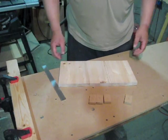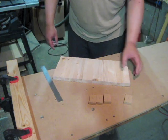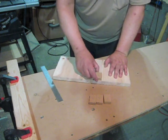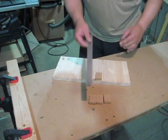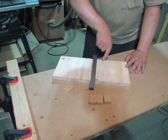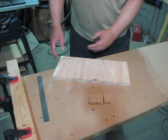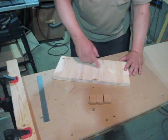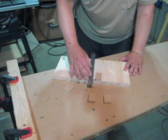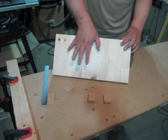So what's the point of these little blocks? Let's pretend this is my sheet of plywood and I've got a line marked — say two feet from the end, and that's the piece I need. I'll use the wide blocks, line them up on my line, and clamp the fence down. That way, when I make the cut, the blade goes on this side of the line, leaving me my two feet. Now supposing I had measured from the other way — say 60 inches. I'll use the narrow block, clamp the fence, and when I make the cut, the blade will be on this side of the line, leaving me my 60 inches.